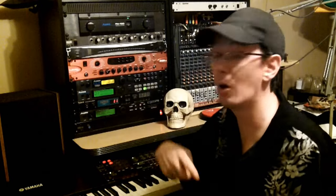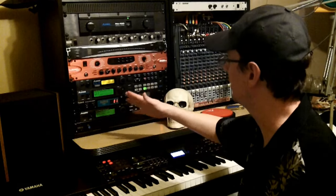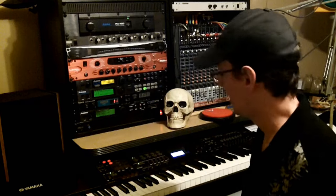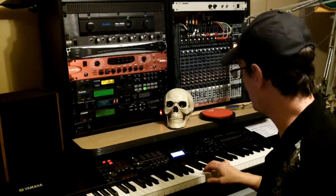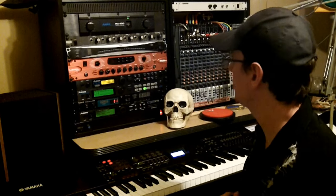So I decided to swap the chips. I swapped the EEPROM chip out of my old DM5 into this one, did a factory reset, loaded all the factory settings, and it started working again — and it works perfectly. It makes all the sounds, all the drum sets are there, the MIDI works. I hooked it up to my keyboard and it works.